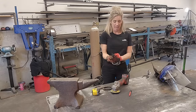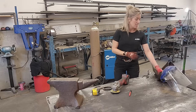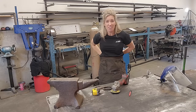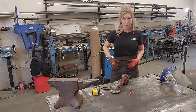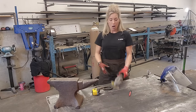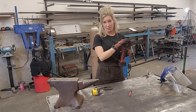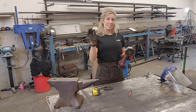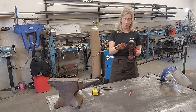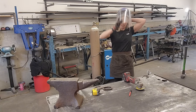When I'm grinding and welding, I tend to have sparks directed to one spot, and in the legs of my jeans and coveralls I tend to get big holes. I found these leather aprons and they are amazing — this one is Dovetail, made for women, but it's really handy because it protects your pants from sparks, grinding, and welding. As for my zip cut, I do not have a guard on it, but I have been doing this for a very long time. If you are new to using a grinder, I absolutely remind you to keep your guard on, always wear a face shield, safety glasses, and hand protection.